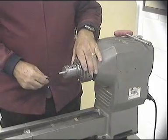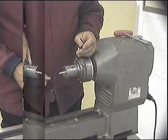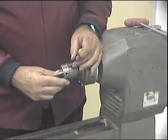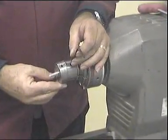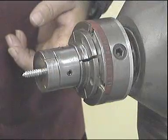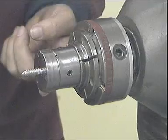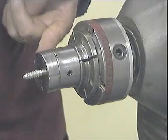With the Wobble Chuck mounted, we can now see how it works. Slackening the grub screws will enable the top to rotate. The wedge design allows the top to be placed at many different angles, allowing eccentric designs to be turned.